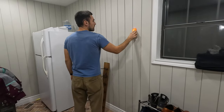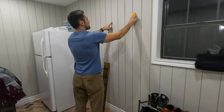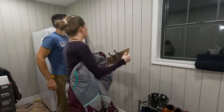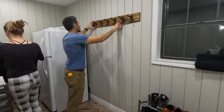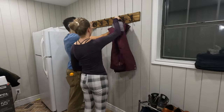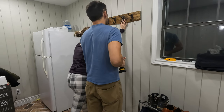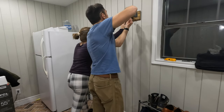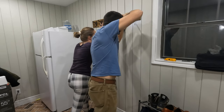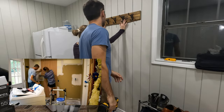We are in our mudroom and ready to install. After double checking the location of our studs, we needed to settle on the right height. A good place to start is about 5 feet off the ground. We are planning to build a bench along this wall, so we used a coat to figure out the perfect height for us, which ended up being closer to 5'6". We used 2.5 inch screws to make sure we got through the board, through our shiplap, through the drywall, and then into the stud. If you want to see how I installed this awesome vertical shiplap, I'll leave the link to that video as well.